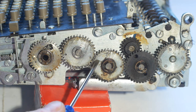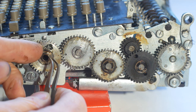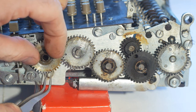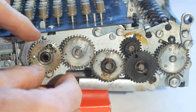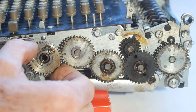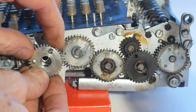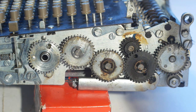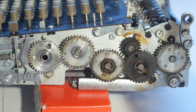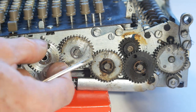I've got all the gears lined up with their alignment marks because you don't really want to get them misaligned. I can take the circlip off, then there's a washer, another washer, and another washer or shim. The grease on this has gone really solid because it's quite reluctant to come off. I'll get that one cleaned up. With it cleaned, we'll get it back on with the alignment mark in position. I've re-lubed the shaft, back on with the two shims, and on with the circlip.